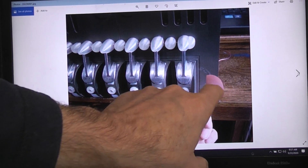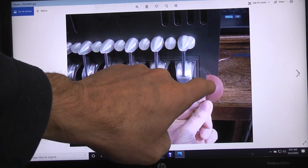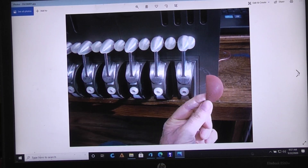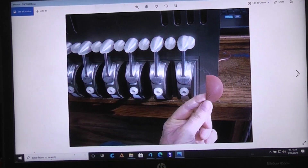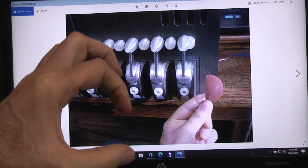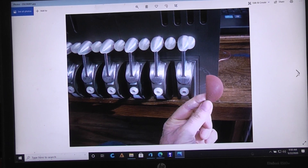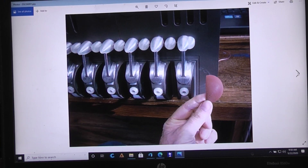Here's the ball end piece. If you have a resin printer you could probably print them in clear resin and then paint the disc part on the back frame red, and when you glue it over it'll look more like the original. In this case I just printed it in white — whatever was loaded — and painted it with a rust red primer to give it the right color look. Another option: you can go to hobby stores and buy clear balls they sell for Christmas ornaments, cut them down with a jeweler's saw, and wedge them in if you want a nice clear plastic ball there.